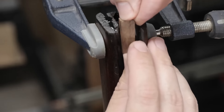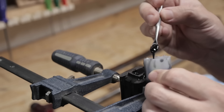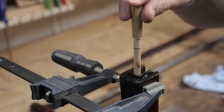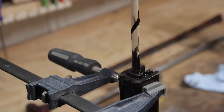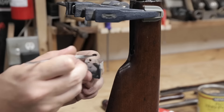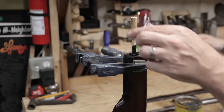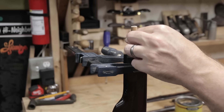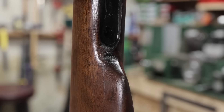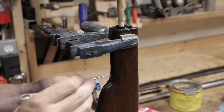To support within the tang, I made this small block shaped as a slight wedge that I'll fit in. After adding more epoxy to the hole, I'll add the dowel, coating it in epoxy, and using it to work it through. Before it's seated all the way, I'll add some more epoxy through the tang screw hole to ensure that it gets pushed all the way through, then I can hammer the dowel all the way. It's hard to tell, but I can see some epoxy squeezing out of this crack — not so much here, but I'm confident that this will be a strong repair. The last thing to do is clean up any excess epoxy.